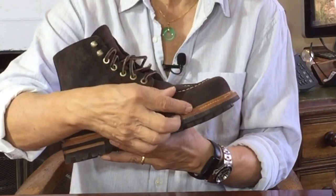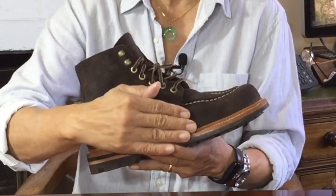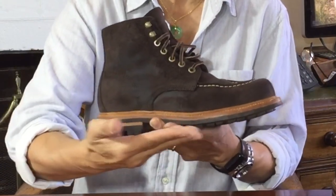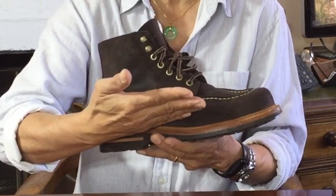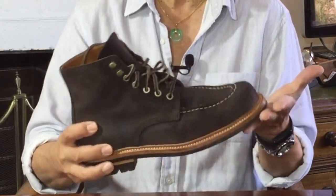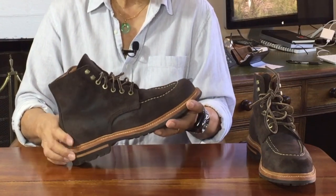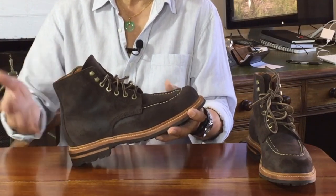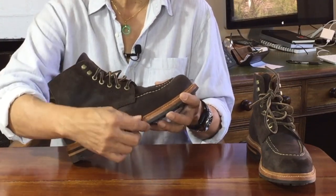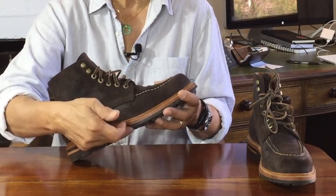This is a storm — or I think more accurately a split reverse welt — where the inside edge of the welt is split. The bottom half is sewn to the uppers inside, while the top half is flanged upwards against the outside of the uppers, increasing water resistance. That's the advantage of Goodyear welted boots: they are more water resistant because they don't have stitch holes going right through the boot, and the welt acts as a barrier between water on the outside and the inside of the boot.